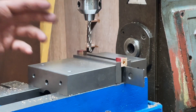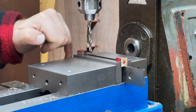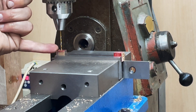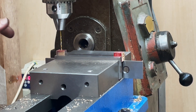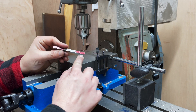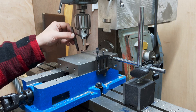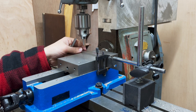This time I'm drilling the holes to retain the springs and an oil hole down into the bore. My plan for making this slightly less painful is to use one side of the vise for all of my axle boxes, with one piece on the other side just to keep the vise parallel. I can then remove each piece, put the next one in, drill down, and keep doing it. I need to drill two holes — one in each end of each stretcher bar. The distance is half an inch from the end and centralised, so an eighth of an inch down the middle.